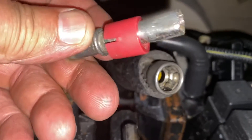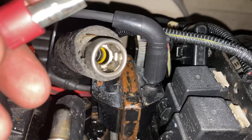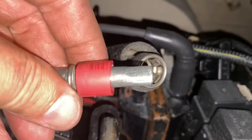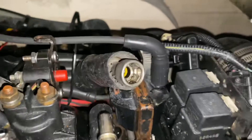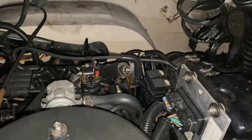So I just want to give you a little tip: if you ever struggle with the tools on how to get these fuel injection connectors or couplings off, take a piece of PEX and cut a notch out like that and it'll slide right in and pop loose quick. That's a little trick that might save you some time. Thanks for watching and subscribe to my channel if you find my videos useful.